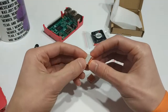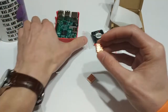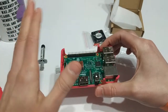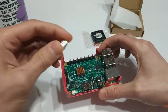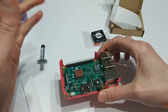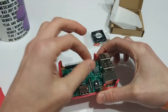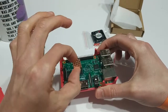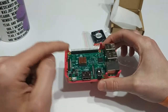All of these guys come with little adhesive pads — they're like thermal adhesive — and basically they're designed so that you just peel that off and plop it right down on there. It will stick on there, and then basically you have some cool passive cooling applied to your Raspberry Pi. This little guy is designed for what I think is the RAM chip, or maybe the Ethernet controller or the USB controller. It generates a little bit of heat, so I'll put it on there just because I have it, but it's not really necessary. The one you want to make sure you stick a heat sink on is your SOC, because that's what's going to be generating the most heat and impacting your performance.